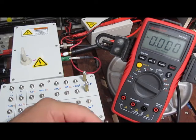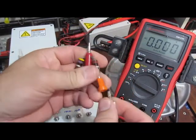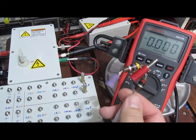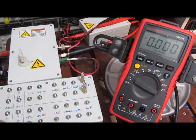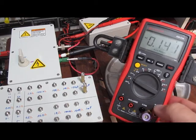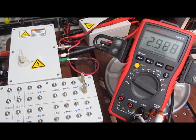Okay, so we're going to start with the amp probe. This is the AM510. And again, we're just going to switch this over to use this 12 ohm resistor. And again, this is in series with 2 ohms inside of the transient generator, giving a 14 ohm source impedance. This meter was already functionally tested, as they all were. Any of the ones that passed had to be functional tested. Okay, so go ahead and get started.